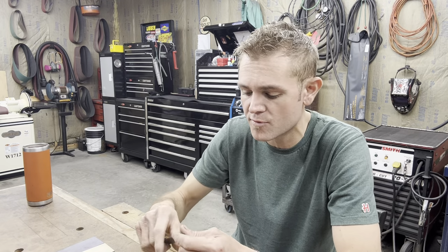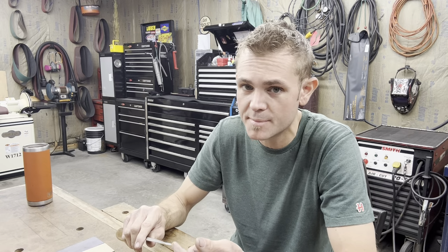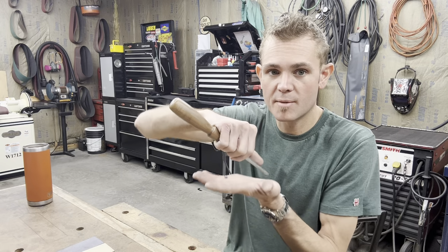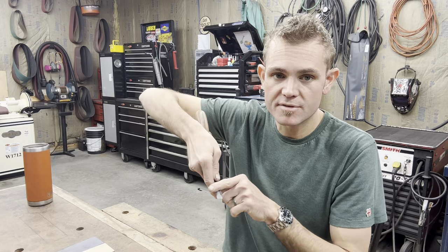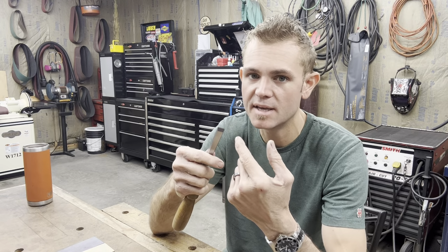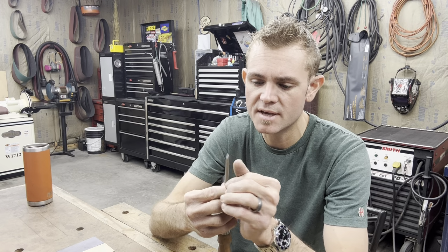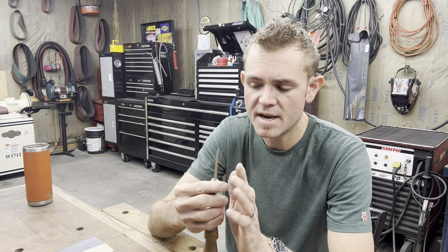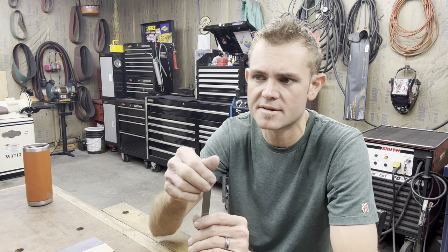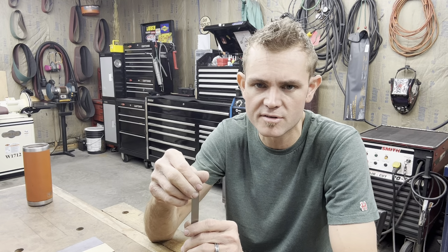So your best performance characteristics are going to be had with a clean apex, which is why I recommend breaking that burr off, starting on a forward stroke the next time, because that will ensure that you have a clean apex. That is what honing is about. Honing is about achieving a clean, fine apex, and it's needless to go past pretty much a black Arkansas stone with just about any steel.